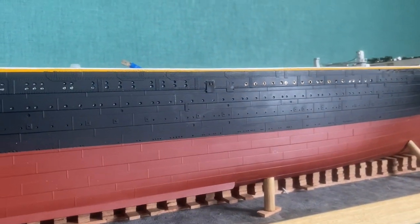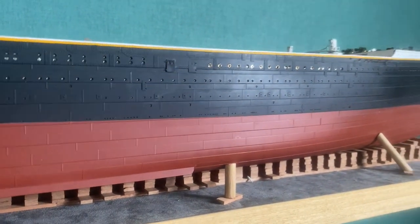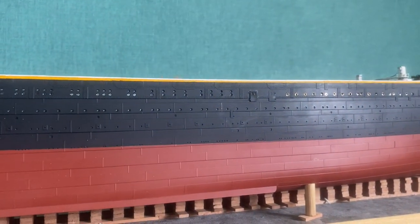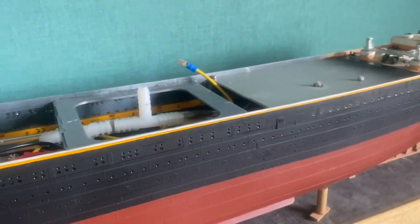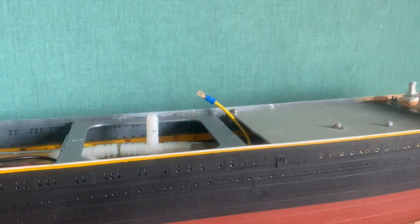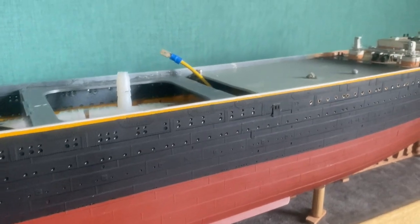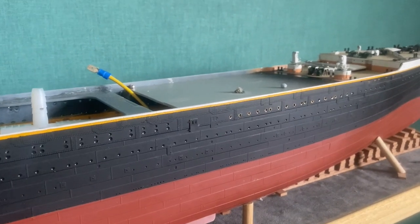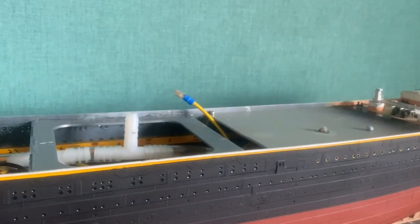The only downside to this is that when you charge a lead acid battery, well, in fact, when you charge most batteries, you produce hydrogen. And to be honest, I suspect this probably isn't going to be an issue for me, but what can happen is hydrogen's a lightweight gas, so the gas will rise, and I was a little bit worried that over time, if, for example, in the winter I don't use the boat very often but I still charge it reasonably routinely, hydrogen might build up in the case, and over time that can build up to an explosive quantity, and obviously that's not ideal.